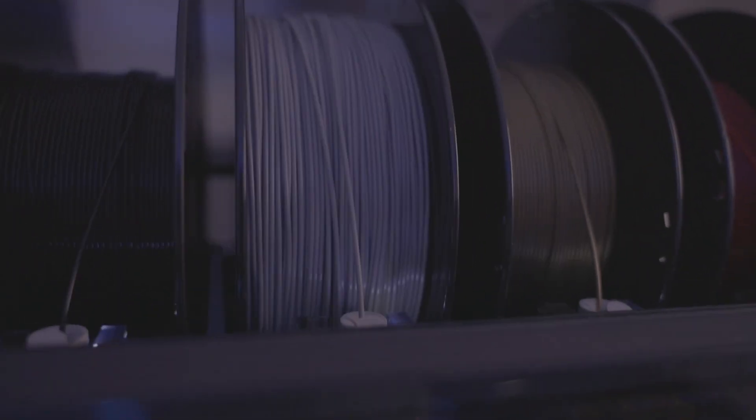What are the cons? Well, they're a relatively new brand, which means they're somewhat untested — though a lot of people have put a lot of hours on them, so we'll see how it goes. They have a couple of proprietary parts; I anticipate the aftermarket will make these parts anyway, but the hot end is proprietary to Bambu. Another con: the AMS doesn't work with cardboard spools and doesn't really work with flexible filaments, so you'll probably have to side-mount the spool for those — not a big deal, but something to keep in mind.